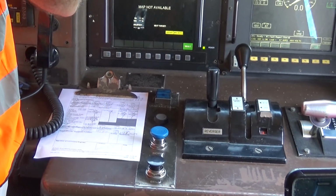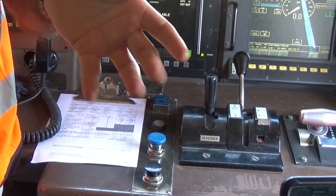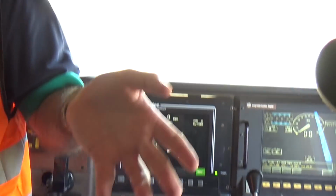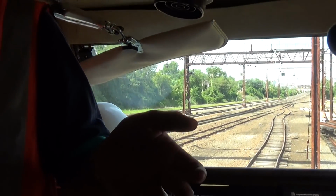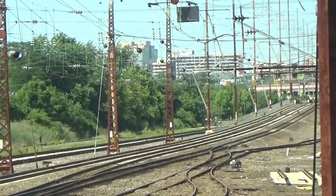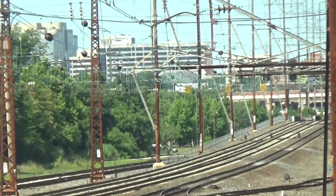A toaster runs on what? Electricity, right? What happens when you run electricity through the toaster? It heats up, right? Makes toast. No toast up there, though. So it puts the electricity into the brake grid, and it dissipates all that energy as heat.